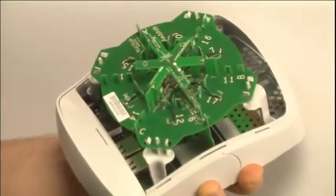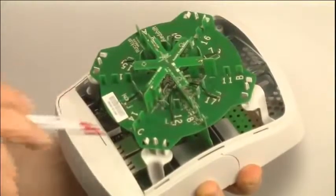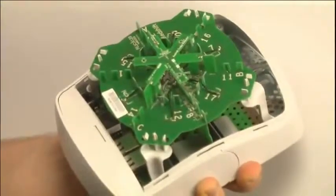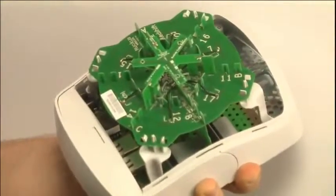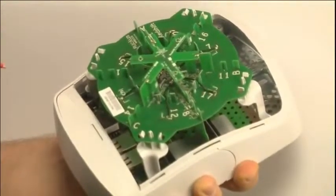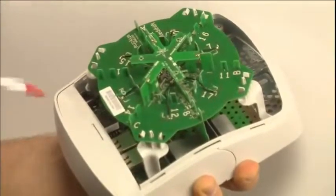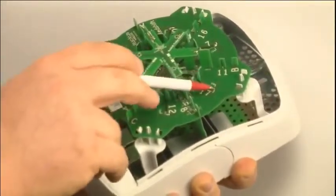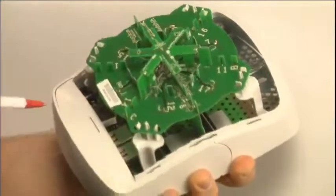Taking the cover off the 7962, you see this fancy antenna system. Now normally, an 802.11n access point from a competitor will have 3 or 4 omnidirectional antennas. What this has is actually an antenna array that is comprised of 19 antenna elements. You can see those elements. You have to look very closely around here, but you actually see these multiple elements.